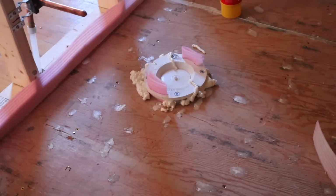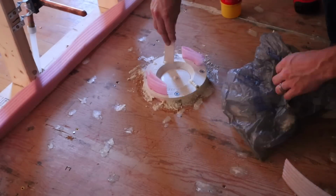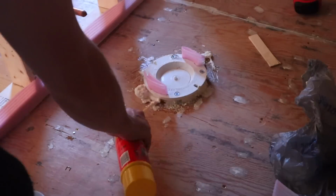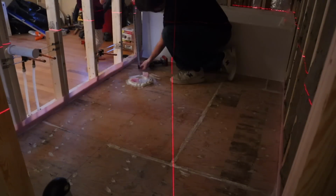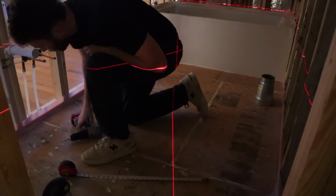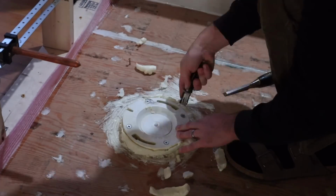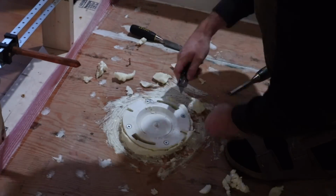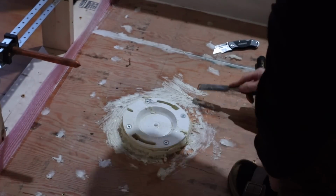The first thing we're taking care of in this room are our sloping floors. I'll link a video here that discusses how we've tried to fix the sloping floors and struggled with that greatly, and a very costly way to try to fix it, and sadly we are still left with about a 1-inch slope to these floors. You're seeing here are subfloors, and there's just not a better way to solve this problem than to just pour some self-leveling concrete. This will give us a smooth base to be applying any tile, and it's honestly just our best option at this point.